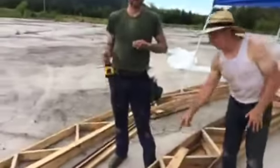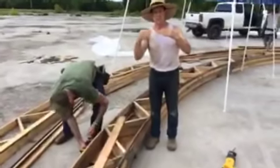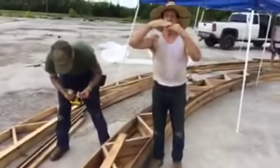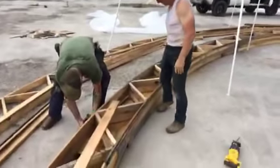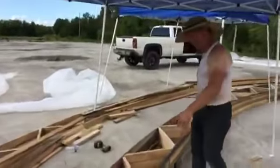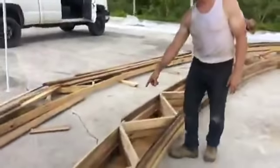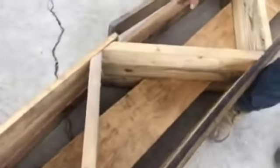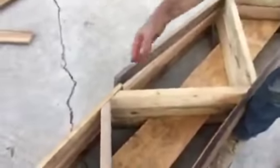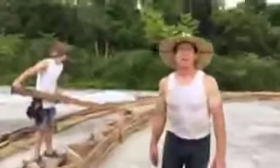Now we're putting in the second layer. We've got one layer and we'll put two layers, staggering our seams. Two boards stop, then we put the other board right on top of that — scabbing in between — then the next board bridges across to bring it together. We glue everything, lots of Liquid Nails on everything. Strong like an egg, strong like a bull!